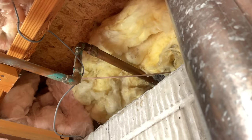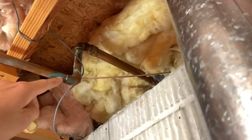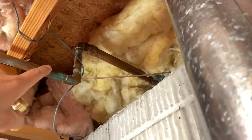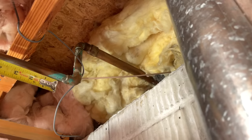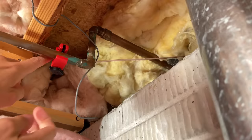I'm going to cut here and use a SharkBite 90, then piece things back together. The plan is to try to use the top portion connected into my new SharkBite spigot. If that works, it saves me a SharkBite 90 and a little bit of half-inch copper pipe. If not, no big deal — I can grab another 90 and piece that in. A half-inch SharkBite needs one inch of pipe to be fully seated, so I'll back away from some messy solder and mark one inch, then use my Milwaukee micro pipe cutter.